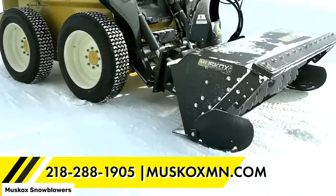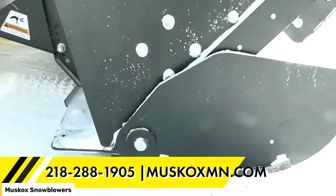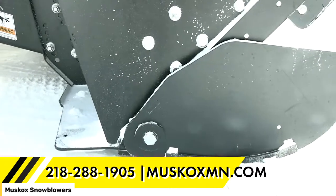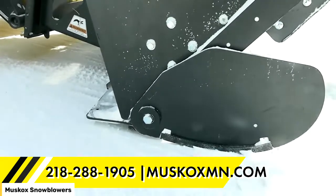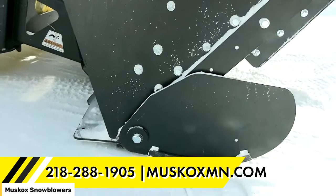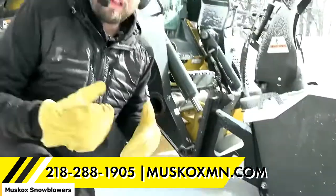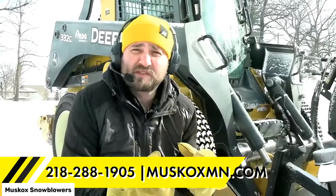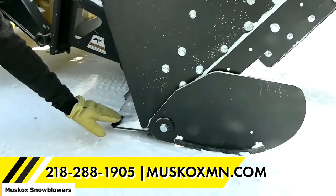No worries. So as you guys can see, we ride on a glide plate. And the reason that we do that is we do not want to ride on our steel cutting edge in our natural forward position. The reason is that steel cutting edge, if we ride on it, we end up smoothing off that edge too quickly. So we're always taking it off in the shop and sharpening it. Also, when we ride on that steel cutting edge, we run the risk of scratching our surface, or if we end up in some grass, tearing up the yard, or if we hit some buckled concrete, we go through the windshield, or if we go over a driveway, like right now we're on gravel, so this is all gravel underneath here. When we ride on that glide plate, it allows us to go over those type of surfaces, grass, hard surfaces, gravel driveways, and not pick up any of those soft impediments and rip them up. So we ride on a glide plate. It's about 585 square inches of a glide plate we ride on.